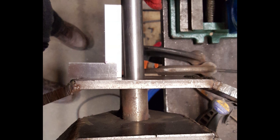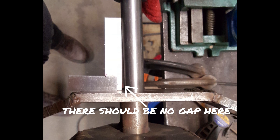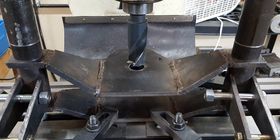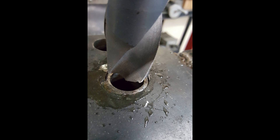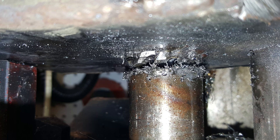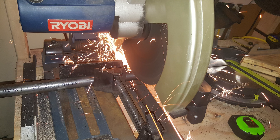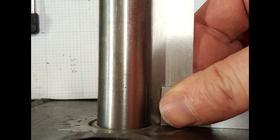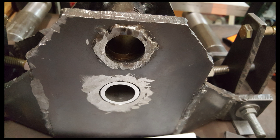I found here that my fork had some serious alignment issues, so while I was in there cutting things out I decided to try to fix these alignment problems as well. This one-inch ID tube passing through the front and rear plate of the fork was welded in and needed to be removed. I first tried to remove it with a large diameter drill bit in my jet knee mill, but even at the slowest setting all I did was tear up the drill bit. I ended up getting an annular cutter, which finally punched through and removed the tube. That tube was welded to both the front and rear plate of the fork and was responsible for the misalignment. So I cut out a new tube, clamped the whole fork down with a new tube insert to make sure everything was lined up properly, squared the end of that tube in the lathe, and after that everything was looking pretty good.